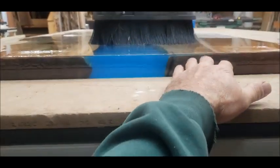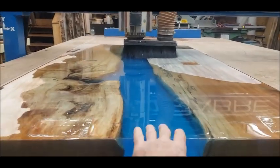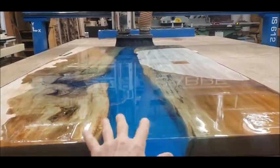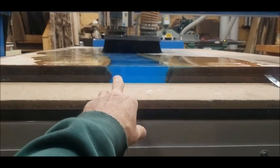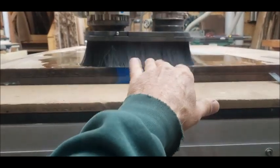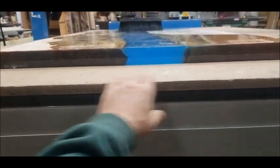What I'm trying to do right now is remove material off each side of this river to relieve the tension that is sucking in more on the top than on the bottom. All epoxy shrinks a certain amount - it doesn't take much. When you overfill and have all this epoxy across the top, it's pulling in on that surface more than on the bottom surface. If you flip this slab over, there's hardly any epoxy spread across the bottom.